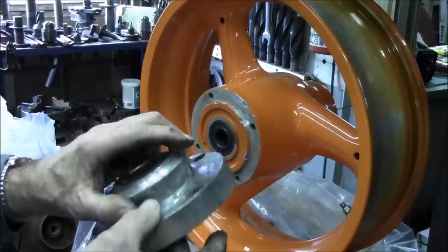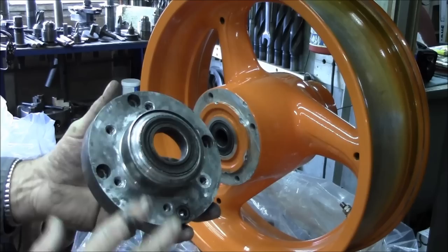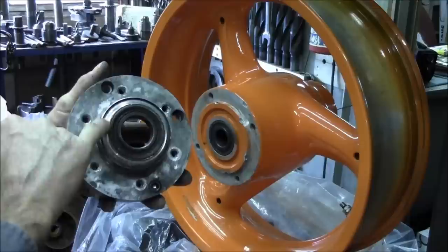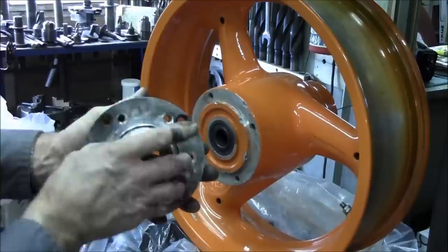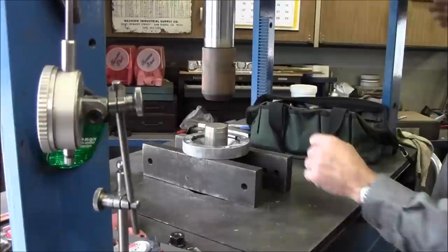And this had a sleeve on here, and I'm not sure, we're going to be looking at maybe making that diameter solid. There is some relief here. This fits in real close to the actual frame that this sets into. So some of this has actually got to have that angle cut into there. That's rubbing where it was making contact. So once this thing got loose and was walking off to the side, it was really gouging in on the side here. So, all right, we're setting it up on parallels here, and we're just gonna take the slug and we're gonna press that out.